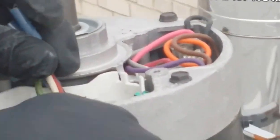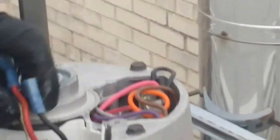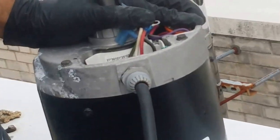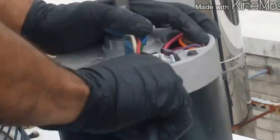These guys are going to drop in there. We're not going to secure anything until we get the blades — we'll just do the wires for now. These are plastic. We'll put them on by hand; if they're going backwards we'll reverse them at the contactor.